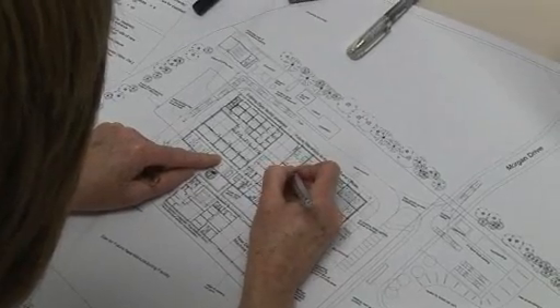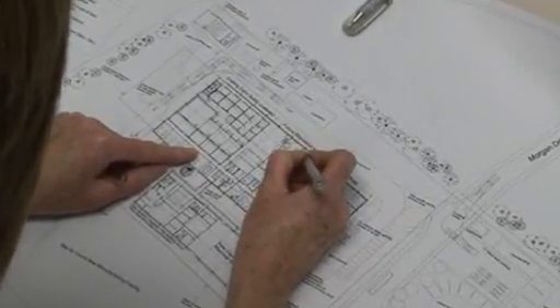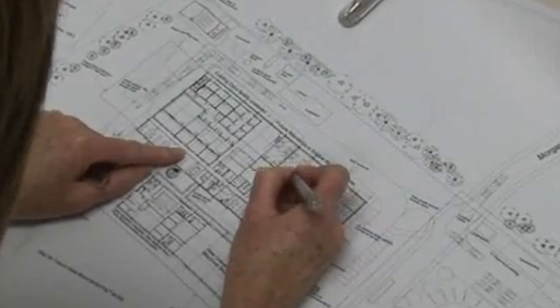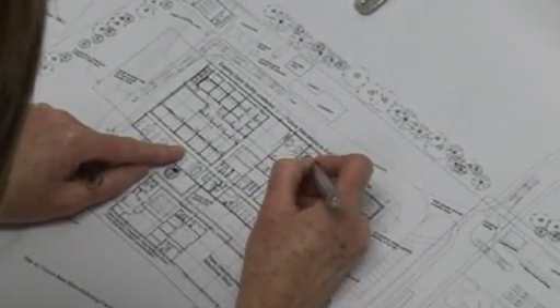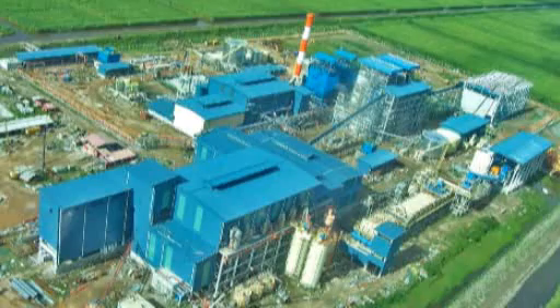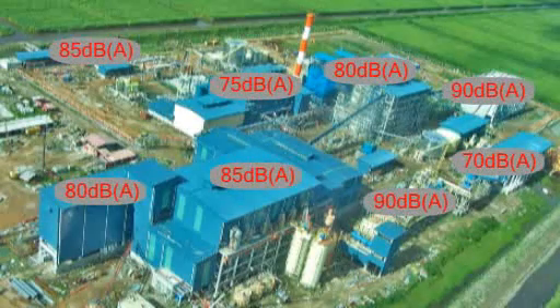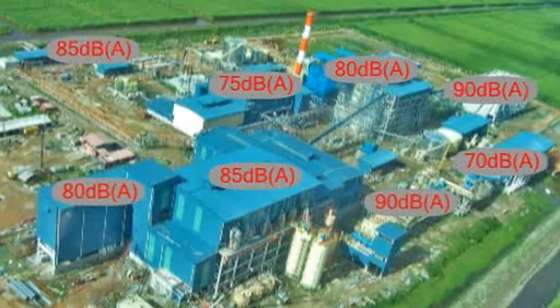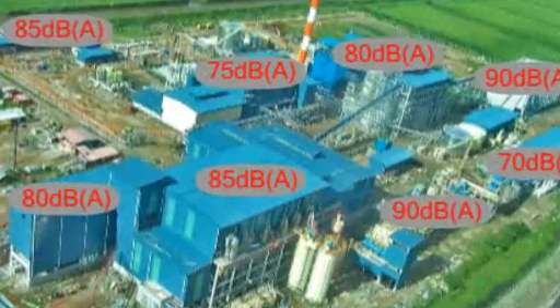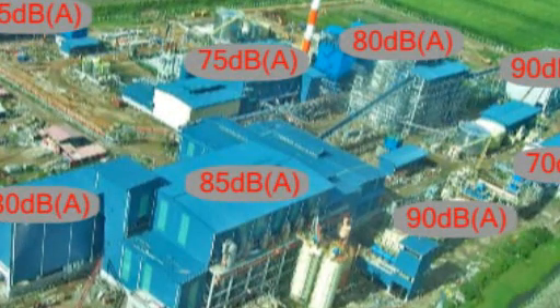The measurement results should be marked up on an up-to-date factory floor plan. Consider segregating areas into hearing protection zones if this is appropriate. Ensure the drawings, and therefore areas of the factory, are marked accordingly. For large sites, it may be prudent to undertake a pre-survey survey to identify the noisy areas. Any area that records less than 80 decibels when the meter is set to A-weighted slow is likely to have an eight-hour LEQ of less than 80 decibels and can largely therefore be ignored.